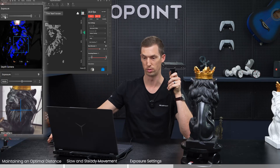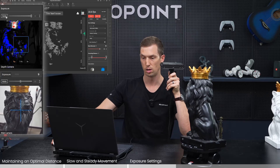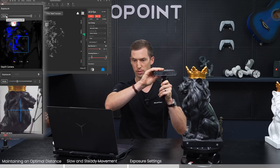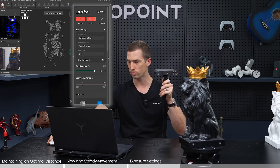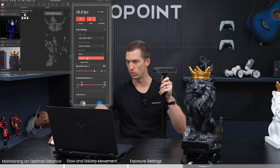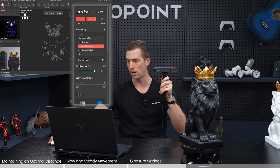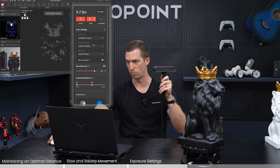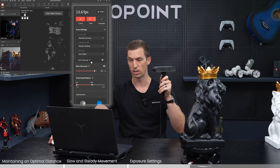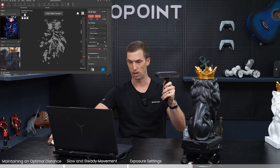Because of the darkness of the color, the exposure needs to go all the way up to 10. But even then it's still missing some points. Another option: go into object type settings. Under high-speed mode you may see a color option, but if you change to standard accuracy or high accuracy and go back to object type, you'll notice a 'Dark Object' option. Clicking that will automatically help you capture the point clouds of a dark item like this lion.